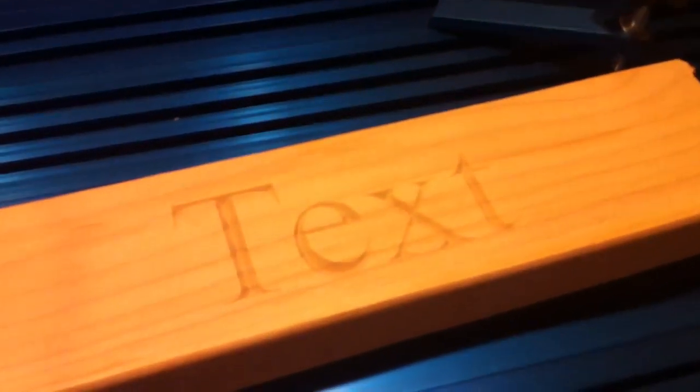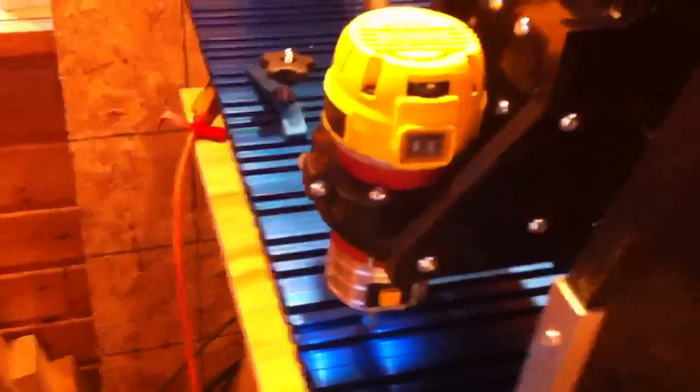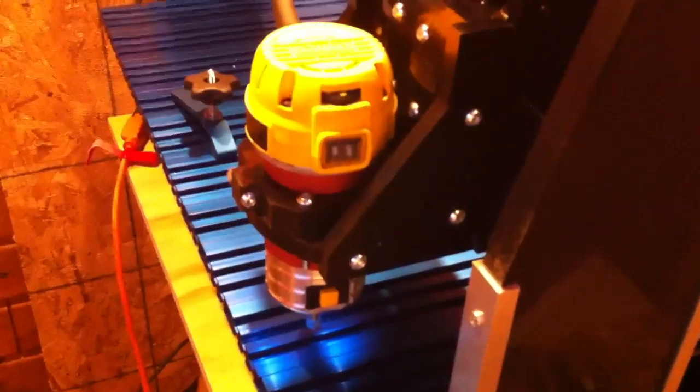No complaints so far. I made a test cut with it — just using the Vectric VCarve software, making some simple text and having it carve it. I had the palm router down to the lowest setting and the cuts were kind of rough. When I sped it up and did it again, the cuts were a lot cleaner. It'd be nice if they made the machine so you could put the Porter Cable router in there — the Porter Cable variable speed router would be really nice. But for the machining size, the palm router will do fine.